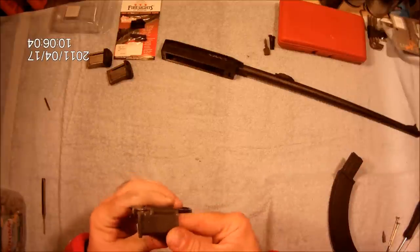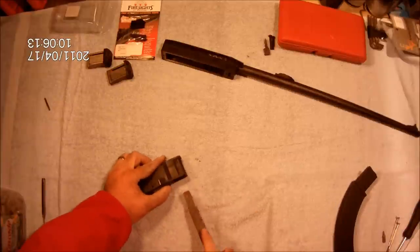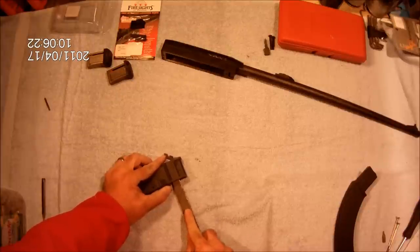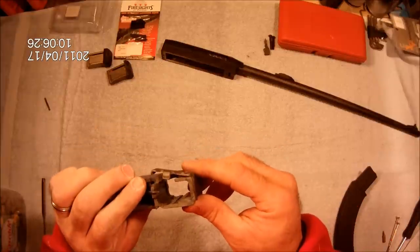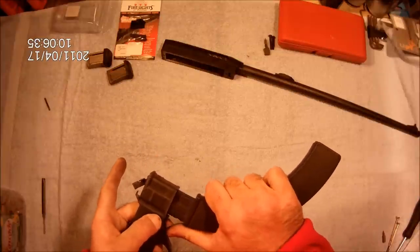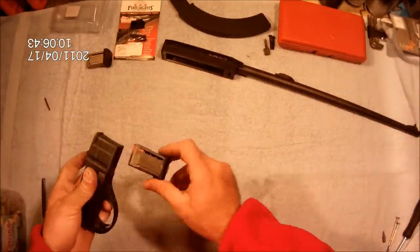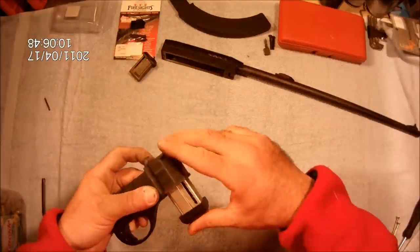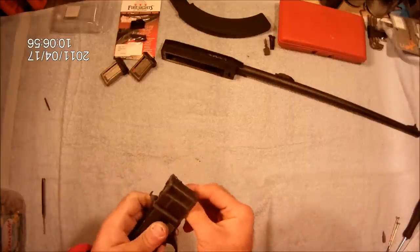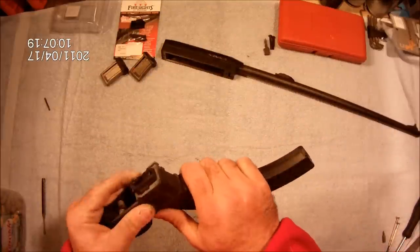Do a little cleanup on the magazine itself too. I don't feel any particular rough spots now — just a little one right there. I want to clean those edges up from the casting. I'm not wanting to make that magwell any bigger than it already is. It's a little better. The small 10-round magazines now drop free, which they weren't even doing before. So there is some improvement there, which is exactly what we're looking for — just a little bit. Occasionally with some injection-molded parts you run into that situation where you get a little ridge.